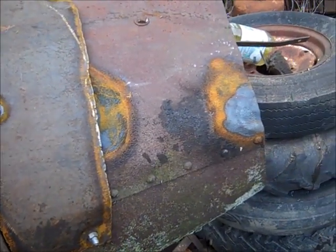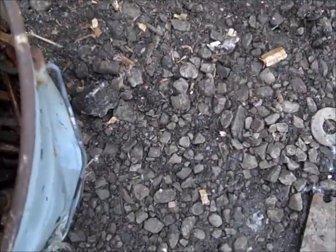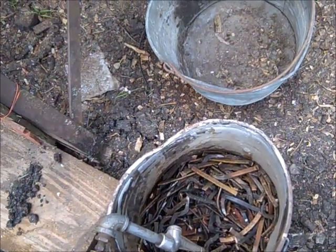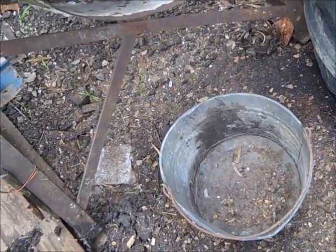I cleaned a bunch of old DC motor-driven welders and had a whole bunch of copper — heavy, heavier pieces — like these right here with varnish and some cloth, string, whatever wrapped around it. I took a sample up to town at a couple places and they said, oh, that's insulated copper, 40 cents a pound. Instead, if it was clean, it'd be $2.50 or $3 maybe. So I decided I need to clean it, and I got the cement mixer going to do some tumbling.